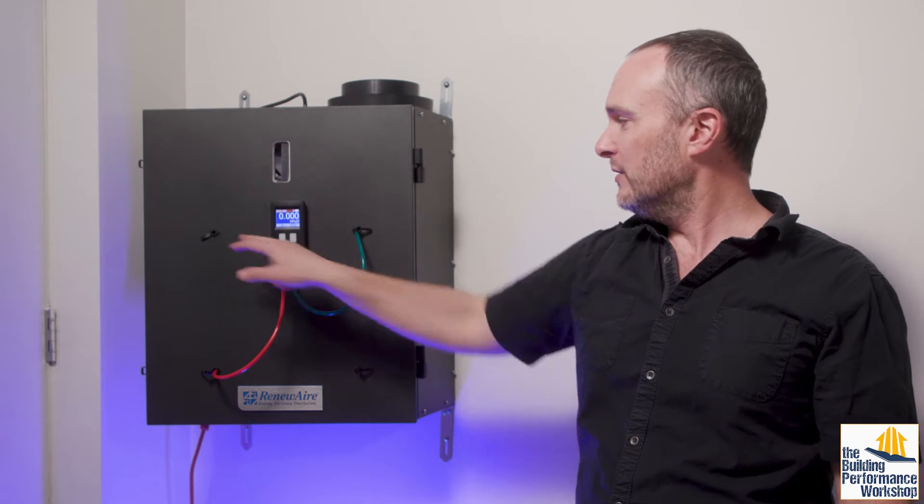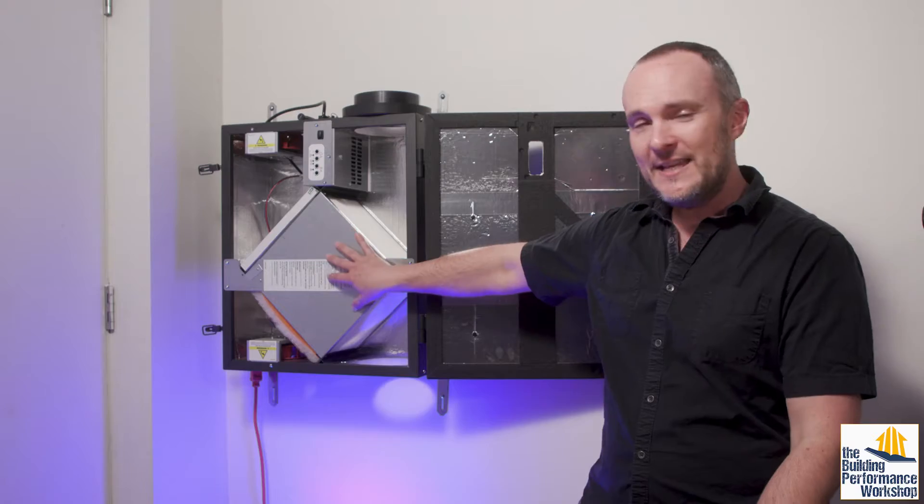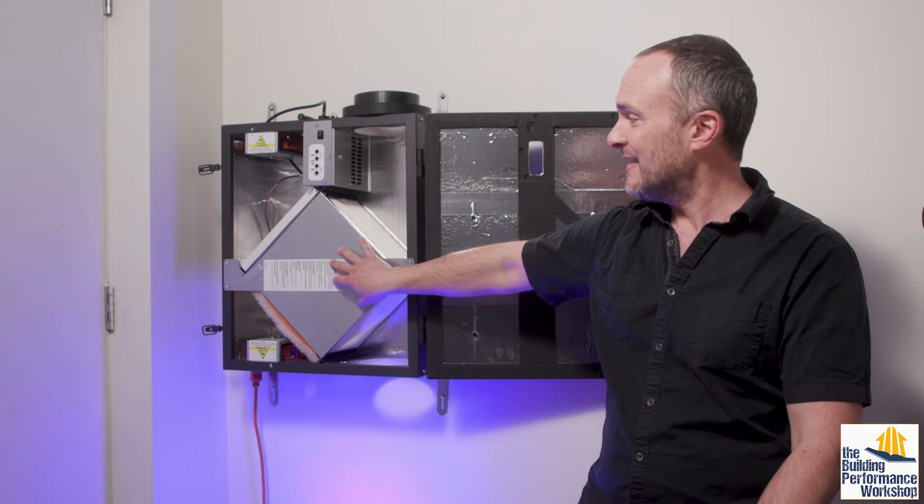We'll take a look at these nipples that you can see here on the front — that's how you're going to do the testing. Let me say a quick caveat: I do not recommend ERVs for everybody. ERVs are just one method for ventilating a home with dilution air from outside. You can also use something like an air cycler if you wanted to do one-way ventilation. If you don't have an extremely airtight home, you could make this dilution work without this actual piece of machinery. These are important for very airtight homes, and you can't basically do bath fans in this case.